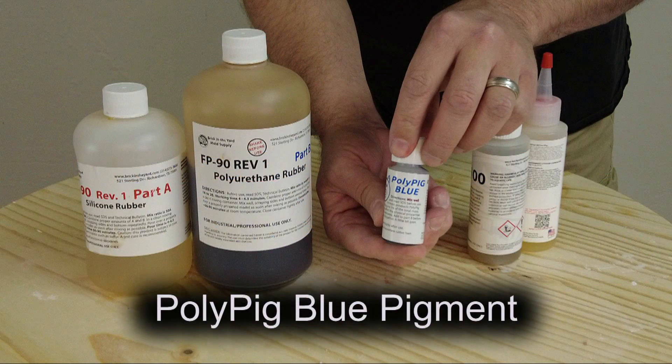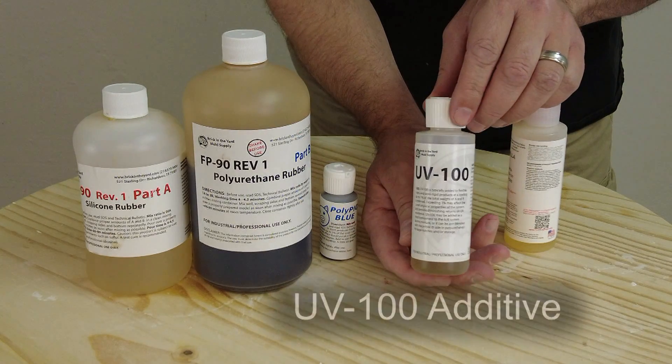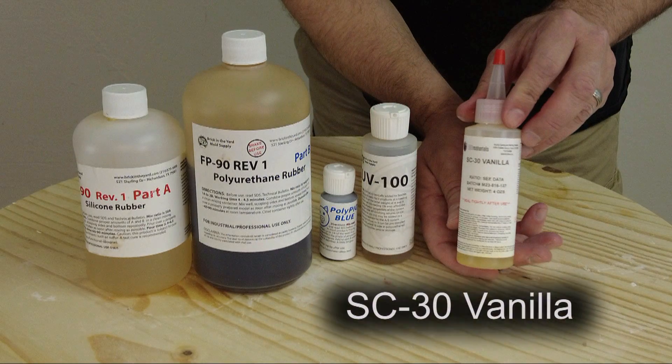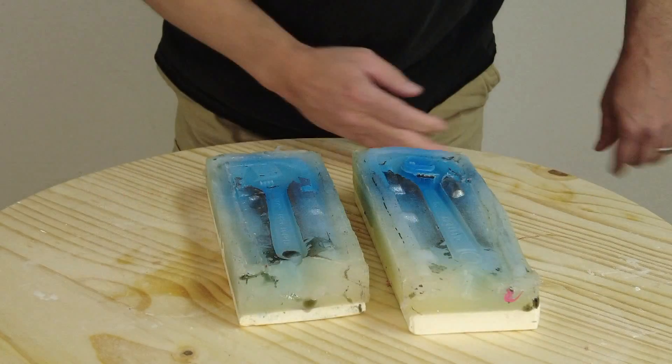In this tutorial I wanted to introduce you to several additives. We're going to add some blue Poly Pig to complement the metallic pigment we'll be using. The UV100 additive is designed to increase resistance to aging from UV light and sunlight — it won't stop it, but it will slow it down. And finally, the SC30 vanilla fragrance can be added to disguise the urethane smell. This is used a lot by customers doing product development and prop making where actors are handling a rubber prop and don't want it to smell like an old tire.